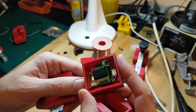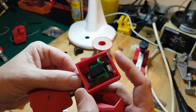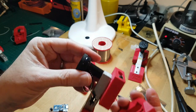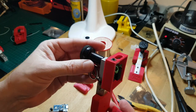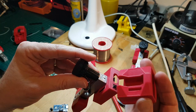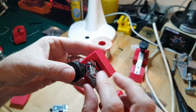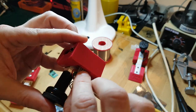So when you come to bind the brake pedal to a game, the binding will actually automatically push the pedal for you, so you don't have to modify your actual brake pedal. So this thing just sits on the outside of your T3PAs and your Pros, and you don't actually have to hack into any cabling whatsoever. So anyway, as you can see, this basically locks in place, holds the whole thing straight, and this then just plugs into that little 4-pin header like so.